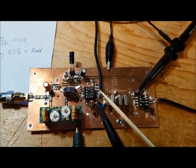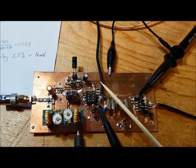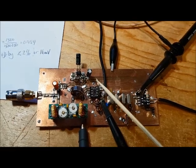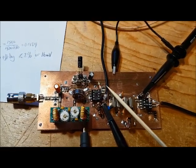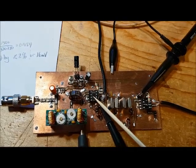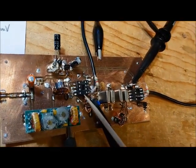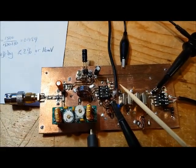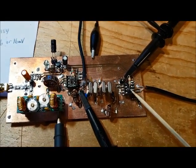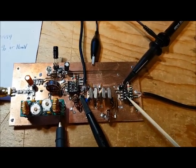What I'll be doing is feeding a signal in, and I have a 1500 ohm resistor in series with the signal generator. This is the local oscillator that's feeding the SA612. There's a 1500 ohm resistor between the local oscillator and the input to the filter. I've removed the SA612 and connected the resistor across the two pins. So the signal generator now looks as if it's 1500 ohms, and I've done the same thing on the output side.